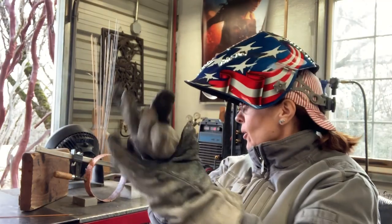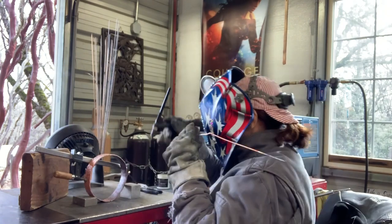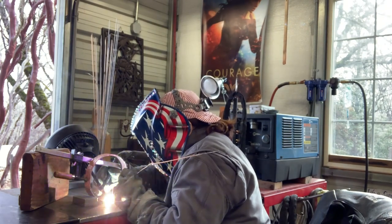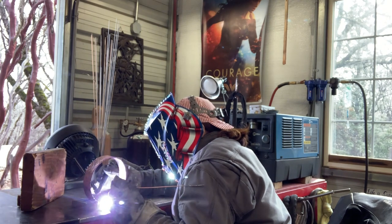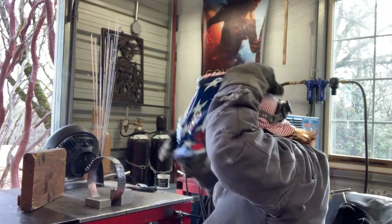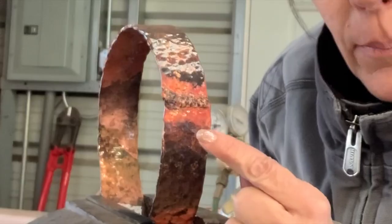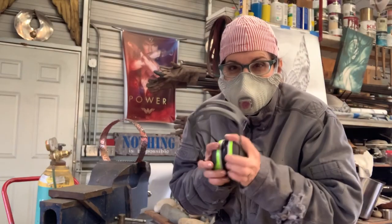I get to weld — it's been way too long! I am going to weld the portal shut right now. Welding copper is interesting — you really get one shot at it. Using the copper welding rod for copper is the way to go. I have a super nice clean weld there, but I'm going to knock the top of the weld off, then hammer it out and it'll be good to go. Might have to touch the inside just a little bit, but not much because it's nice.